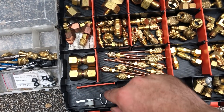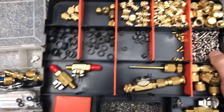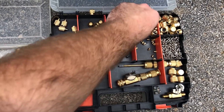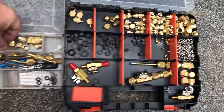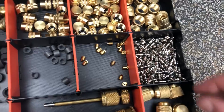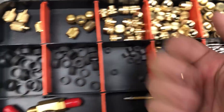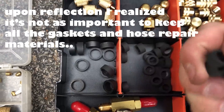I'll grab another little plastic core tool remover, just as a backup. I'll get a good handful of three-eighths caps, some five-sixteenths caps. Anytime I come across a unit with plastic ones, I try to replace them. I'll get some five-sixteenths for the mini splits, the VRF equipment, stuff like that. A big handful of Schrader cores. Some depressors and a variety of gaskets — three-eighths, five-sixteenths, quarter-inch, the usual suspects.